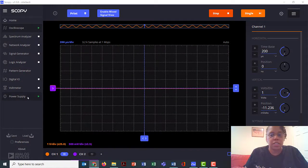Okay, we're gonna try this again. So what we found was wrong was that pin one of the op amp is just saturated with stuff, and there weren't enough nodes for me to get everything on pin one. So one of them was off, so I had to make a mini bus on another row for that. So that's what was wrong with that.